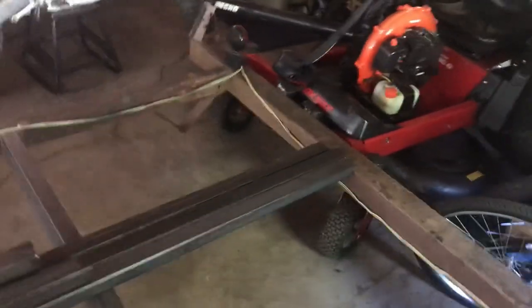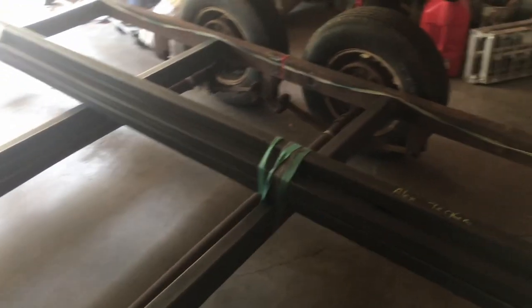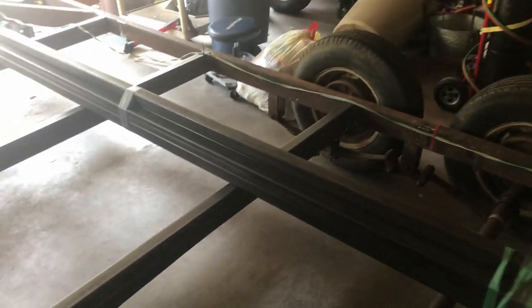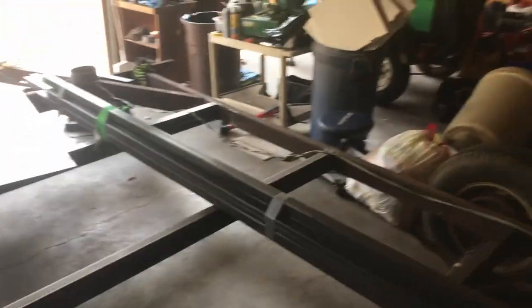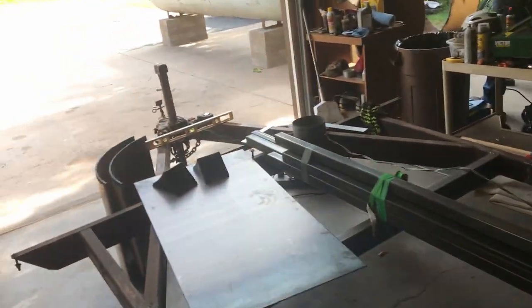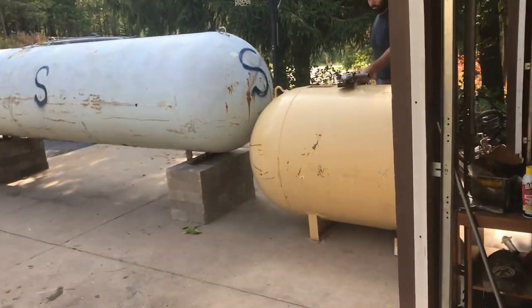This last crossbar here though, we're not sure if the firebox is going to hit it if we dip it too far low. So if we go all the way to the bottom, that's going to be, what do we say, 3 inches for the main cook chamber off of the rail here. So it'd be quite a bit lower. But we're hoping to get the answer to how high we actually can go, or how low we can go, once we figure out how long and where the firebox is going to be sitting.